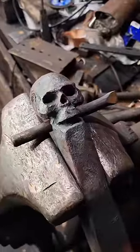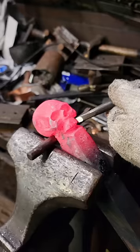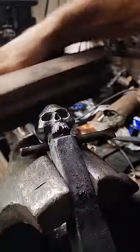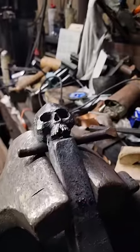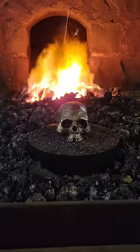A mass of steel is heated to a yellow heat, and then hammers, chisels, and punches are used to deform and manipulate the material to the finished shape. In skillful hands, little or no subsequent machining processes are necessary. It is a challenging yet rewarding discipline.